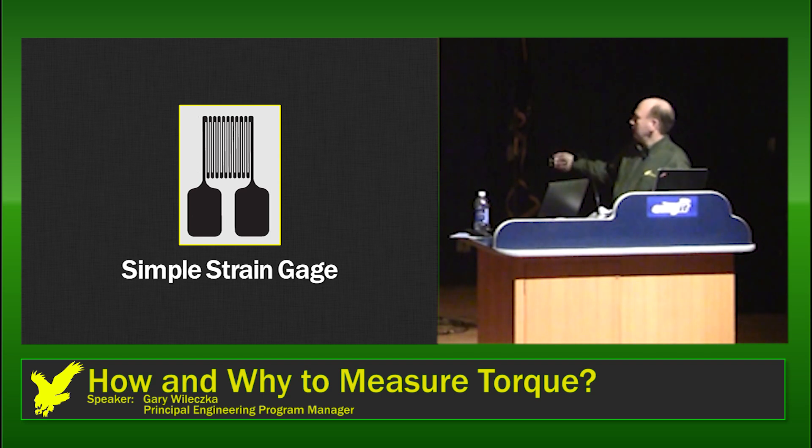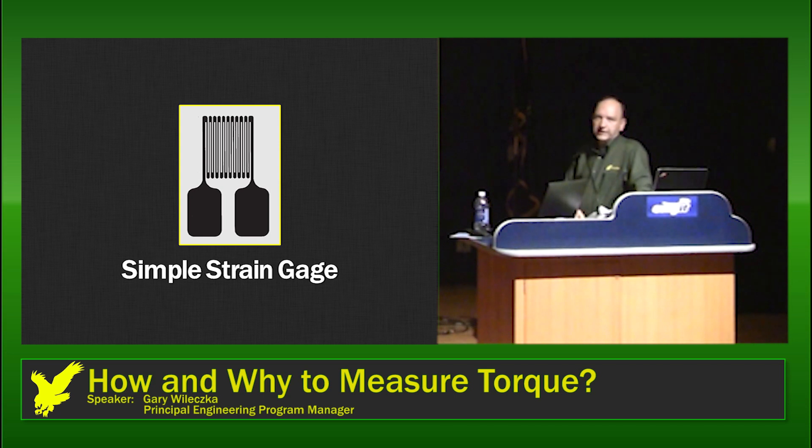The system uses a strain gauge. What is a strain gauge? Basically it measures strain — how much a piece of material stretches per unit length. If we take a 10-inch-long piece of steel and stretch it 10 thousandths of an inch, that's one unit of stretch over a thousand units of length. You could also say that's a thousand units of stretch over a million units of length — called a thousand micro-strain. The micro is a millionth, and that's the area we're working in when we talk about torque meters, around a thousand micro-strain, or about a ten-thousandths of an inch over a ten-inch length.